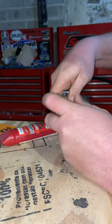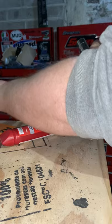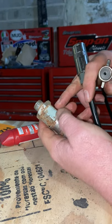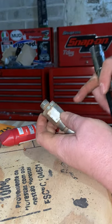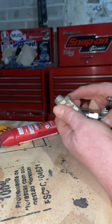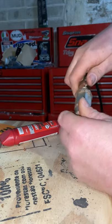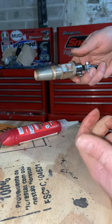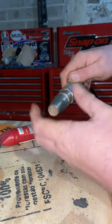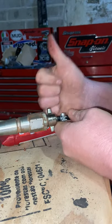What you can also do — I don't like carrying two separate fittings. So instead of going from that fitting to that fitting, I've got the same half-inch BSP body, but rather than going half-inch to quarter-inch BSP for the PCL fitting, I've gone half-inch to M16 1.5 pitch. That means I can screw my test adapter straight on. So if I'm going off air brakes I use it one way; if I'm going off the test point I use it the other — just means I'm only carrying one dongle. Because as we all know, having two pokey bits is just greedy.